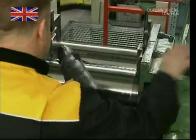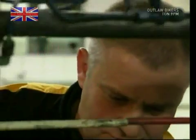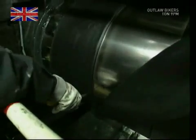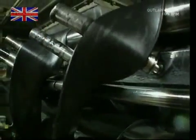It has to be mixed up really well, so the rubber will be passed through the rollers a few times. Once it's ready, the tire chef can add all the other ingredients — things like mineral oil, silica, zinc oxide, and sulfur are thrown into the mix. It sounds quite technical, but basically they improve the tire's elasticity, density, and durability. This whole process is exactly the same on the larger rollers, just on a far bigger scale.